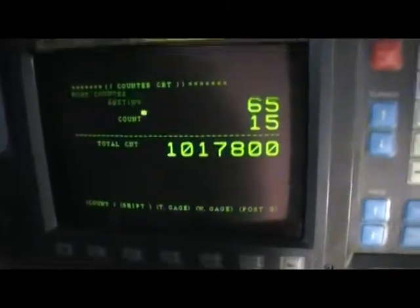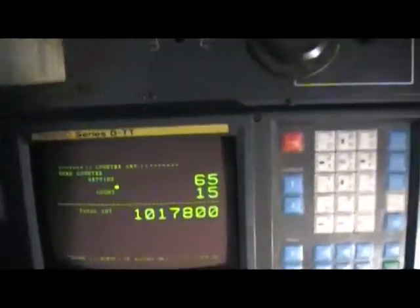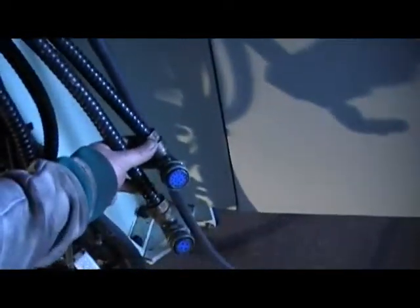Also you have in-chute operation, which is disabled right now, so you can have a say what you can do with a stacker table, out-chute, in-chute, and you can program it. You have count of parts you can make, you can shift. There's no option for that. Actually, you should be able to shift the stacker tables and everything on that. This is a counter CRT, and if you have a different kind of stacking table, which you need interfacing with emergency and all other units, you have it right here. You have 3-phase power in this plug, and all the interfaces for a stacking table, if you need a different stacking table and if you wanted to have it running.